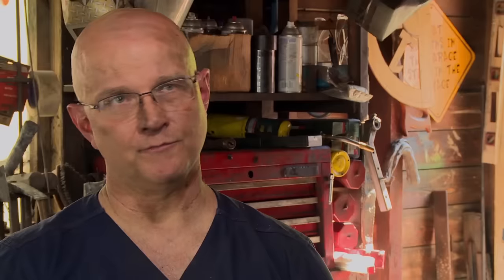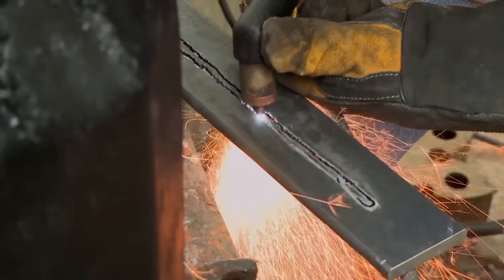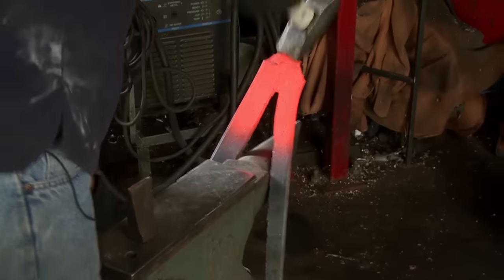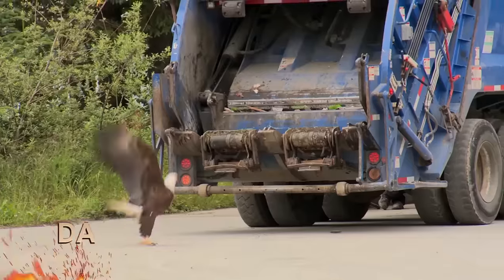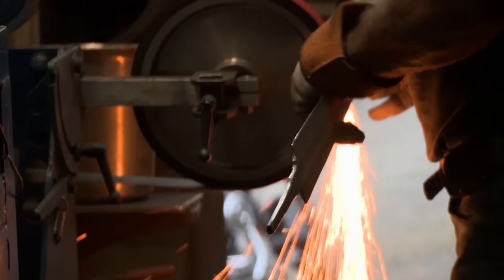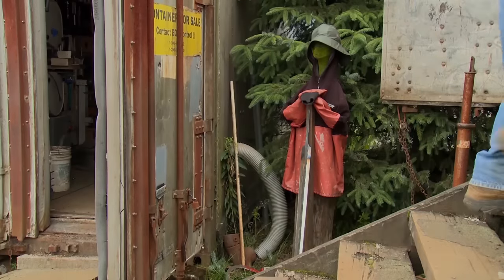The dimensions that I'm shooting for are 36 inches in length and under three pounds. I could cut it and forge weld it, split it, or draw it all out. But the plan is to pull the sword out sort of like that. I have never unfolded metal this way before, and this is a big piece of steel. The main thing with this sword is to remove weight, so we're going to work on weight reduction and get the fuller in there. Just a quick, dirty fuller ground in there. I have to start thinking about my heat treat, too.